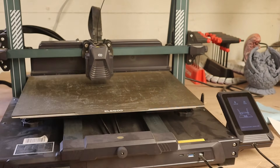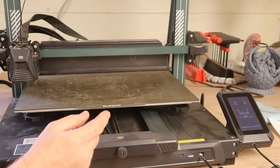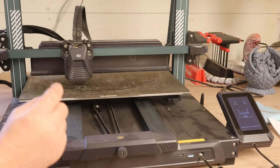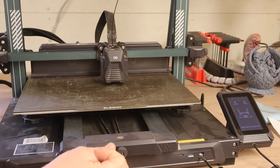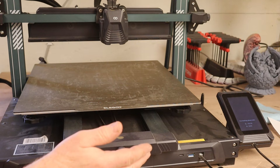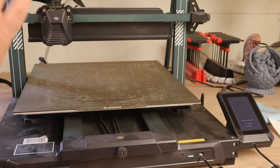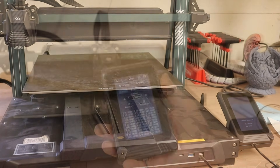It's going to do the same process again — take 10 minutes to run through all 121 points — and it's going to come back to that screen again. Check your numbers, adjust the wheels, run the calibration again. Keep doing that over and over until you've gotten relatively close to zero. I'm usually happy if I can get everything around 0.15 to 0.2 — I've gotten pretty good prints out of that. You want it as close to zero as possible.